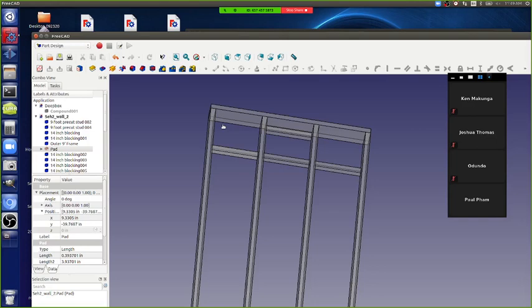Off of the 2x12. Yeah. So take the circular saw and run it up there. You can do it in place. You don't have to take it off, so you don't have to dismount too many things. Just take off the outer stud, cut the 2x12s, and then put the longer pre-cut stud, typically the 9-foot pre-cut for the first floor, the 8-foot pre-cut for the second floor.